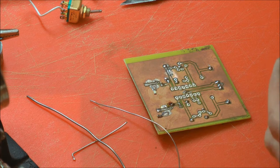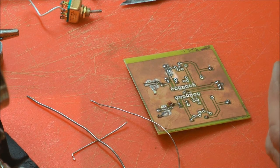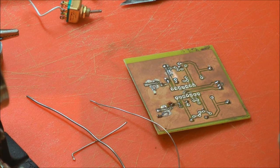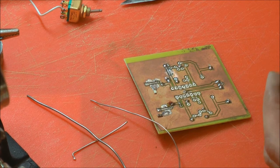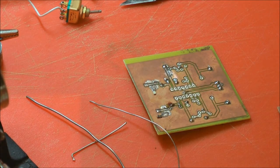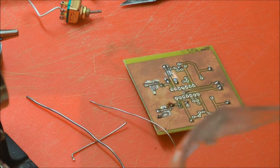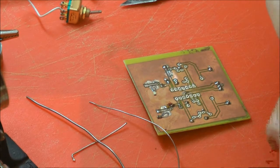Try using the eye bath, or just the litre bottle of saline wash, to try and wash something out of your eye. So just throwing water in it. Yeah. But if you cut those before you solder, wear glasses. I always leave them long and solder and then cut. This is what I'm going to come to. If you don't wear glasses or good coverage, I do recommend getting a cheap pair of safety specs.